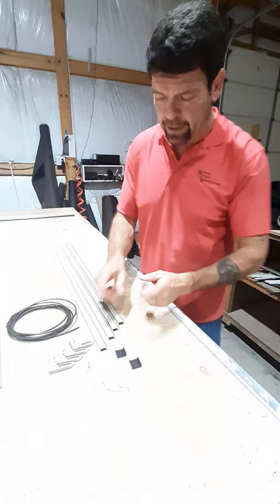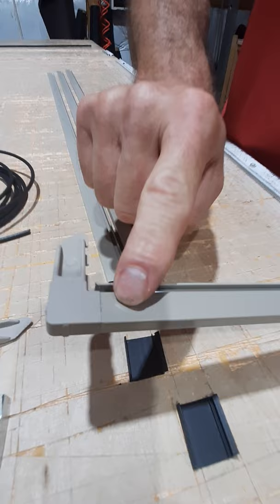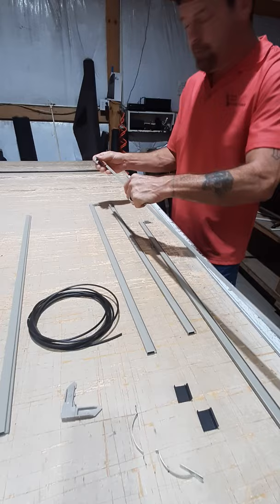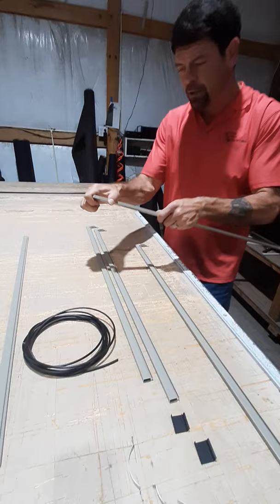This particular window I've already cut is a 34 inch square. I'm right-handed, so I'll take these corners and they just slide right in — very snug, very clean, same color, so it looks flawless. I'm going to do that to all four pre-cut pieces. Whether you have a miter saw or just a hand saw, it doesn't matter — just take your time, and the aluminum should not splinter, because we're creating box squared corners, not angles.